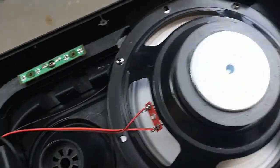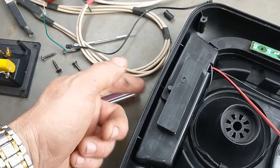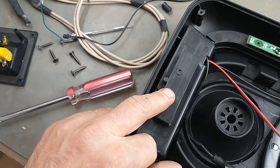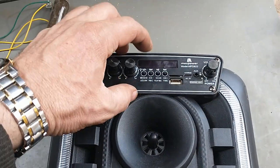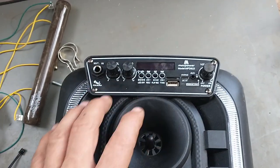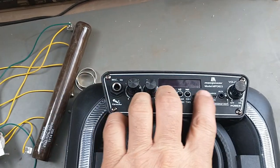sides. So all we've got in here is one speaker driver, and then all the electronics is in this little box here, which you can access from the front. And this little protrusion here, this is the battery. It takes an 18650. I don't know what I did with it, but I already replaced that. Not too hard to do, actually, because it's these 4 screws, and then this whole thing comes out. All the electronics comes out. Just those 4 screws. The battery itself is mounted in the case itself, in that little protrusion, as I said. But the electronics are all just this one thing.